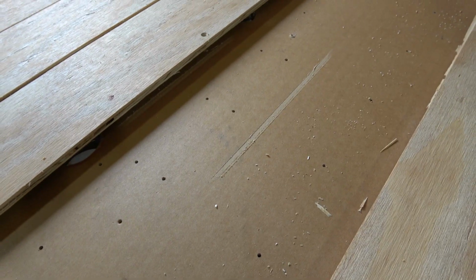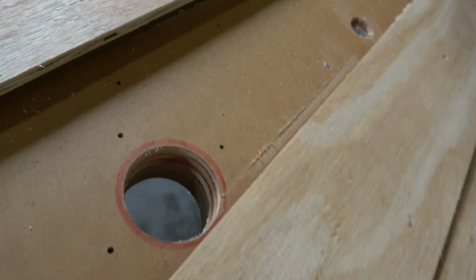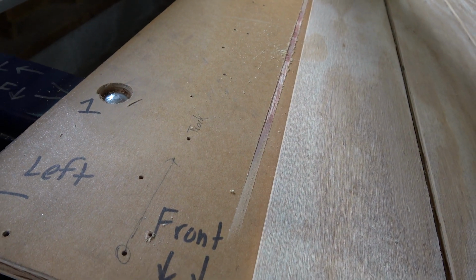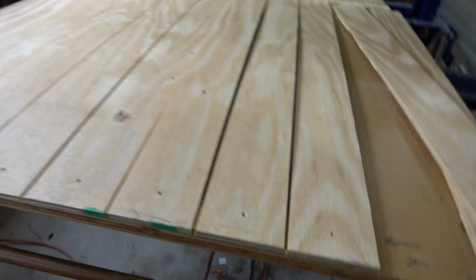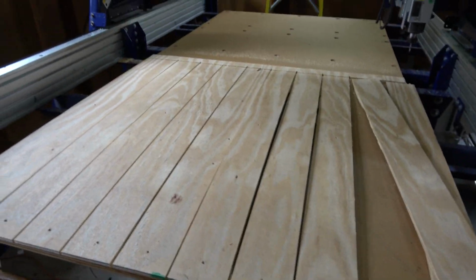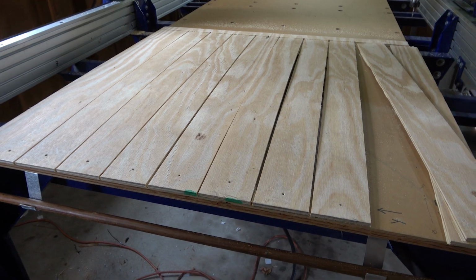So you see the bow in the wood messed up the Z, so that part was a little less accurate. Yeah, a little bit there too. And a little bit there. Some bite into our base on the left, not so much on the right, which means the right is a little lower. Pretty good parameter work. All right, so I'm going to pull these off, clean them up, make another set, and then we'll work on the Sintra, which is actually the complex part.